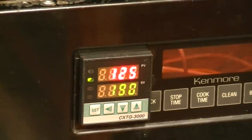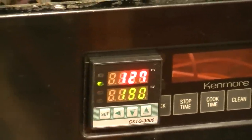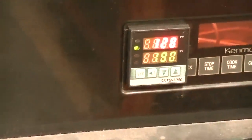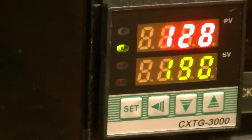What I'm not sure about and trying to test right now - part of why I chose 190 - is whether with this thermocouple it's going to measure too slowly or not get a good reading. What's going to tell us is when we see it getting up to 170 or 180 degrees - if it starts cutting power to the relays early and coasts on up to 190, then we'll know the fuzzy logic is working properly and we're in good shape.